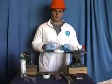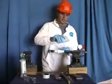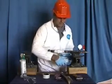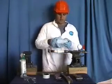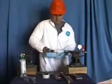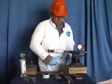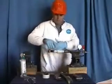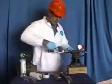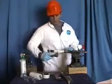Once we've applied the composite sleeve, we're going to utilize the compression film to lock the repair in place. Compression film needs to be applied in the same direction as the pressure sealing tape and the composite wrap. Apply it just outside the repair. Apply tension, 2 layers over the repair site. Utilize our perforating tool to perforate the surface. This will allow the CO2 gas to escape by locking the resin into the composite during the curing process.